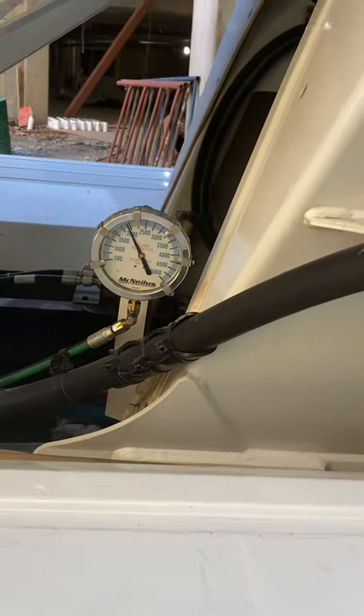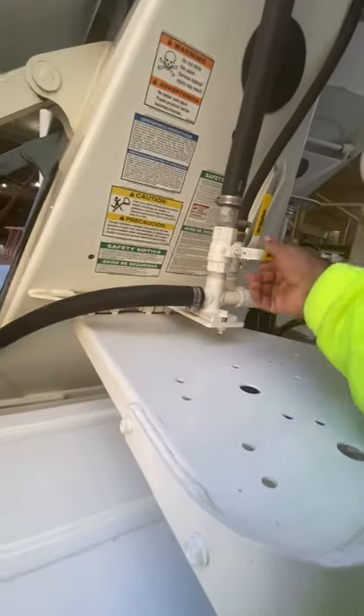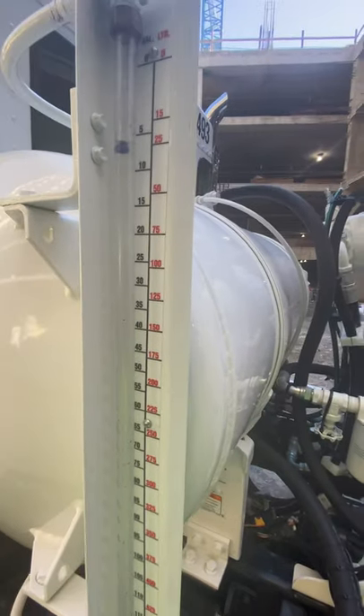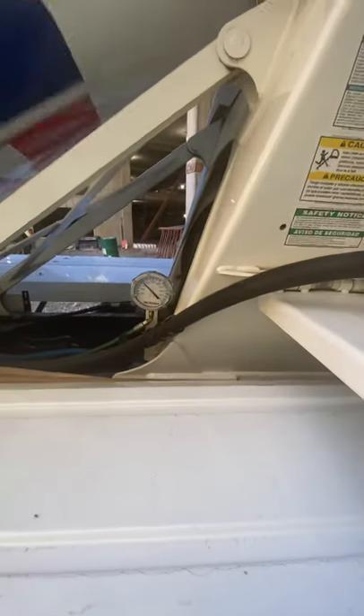I'd say he's sitting on a six inch slump. They want a seven inch slump so we gotta add some water. Over here we got a meter to tell you how much water is going in there. But you can't always trust the meter — you got to know about the sound of the concrete, you got to know what the mud sounds like.